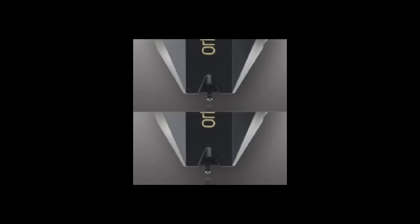Here we have a photo of an Ortofon cartridge. The top photo shows a cantilever which, in dynamic action, will go straight up and down. On the bottom, the same cartridge is twisted slightly off-axis — the cantilever does not go straight up and down. But if you perform your alignment simply based on a static, post-landed position, it will not reveal the uneven pressure being exerted onto the cantilever causing it to have a diagonal up and down movement. You can even see that the stylus is slightly off-axis based on the magnified photo. We cannot emphasize enough the importance of landing behavior, because if there is uneven pressure exerted on the cantilever, over time it will cause it to bend towards the left or the right and become off-centered in an idle position.